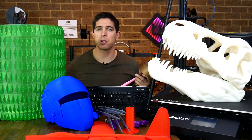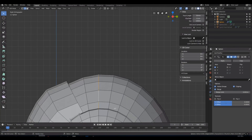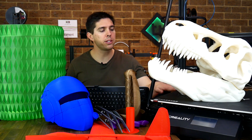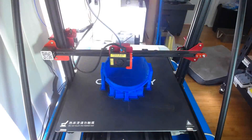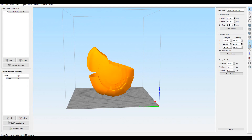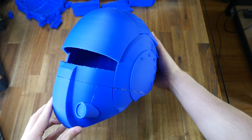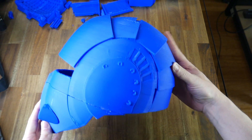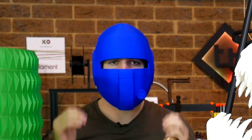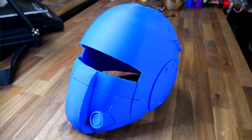My final print was really special, because it was modelled in Blender for me by fellow Aussie YouTuber Markham3D. His video is linked in the description and has a super satisfying time lapse, and the STL is also linked for free. I figured I needed my own time lapse to do it justice, so I hooked up OctoPrint to this printer and got it going. The OctoLapse was going well, but later that night I realised the filament run-out sensor wouldn't work while printing from OctoPrint. I therefore had to eyeball the cutoff point and reprint the last section, dropping it below the bed surface in Simplify3D to cut off what I already had. I've performed a tiny bit of clean-up, and at this stage the two halves are only hot glued together. This printer is going to be great for cosplay items like that.